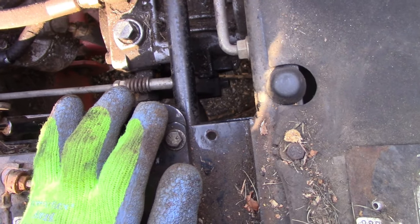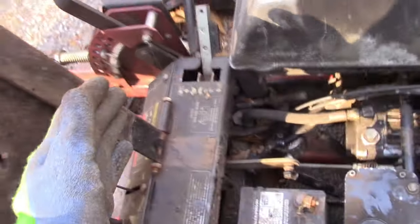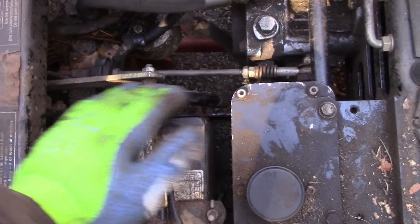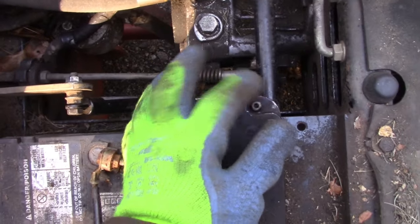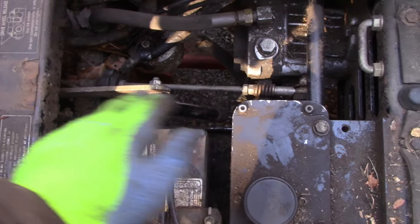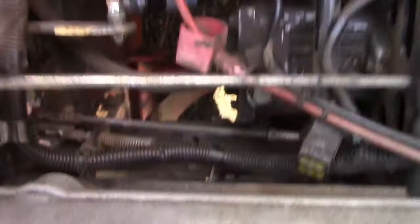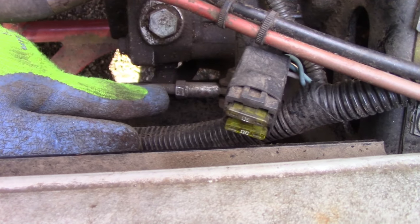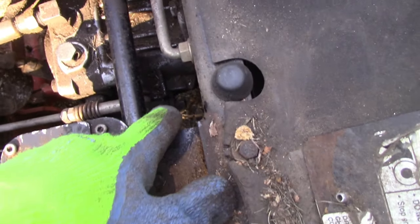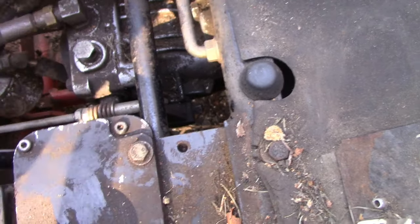If you need to make an adjustment — slide it forward or backward a little — so be it. But usually just setting them in a neutral position with the handlebars neutral is enough. If you didn't touch any of the linkage and you're watching this video because you have this problem, generally these machines don't get out of adjustment on their own. Just go right to these set bolts — they're just a small bolt that pinches the input shaft for your forward and back. That's all I got, thanks for watching.